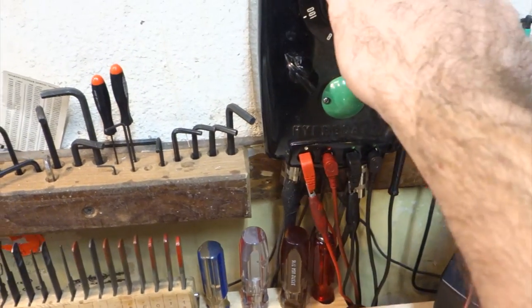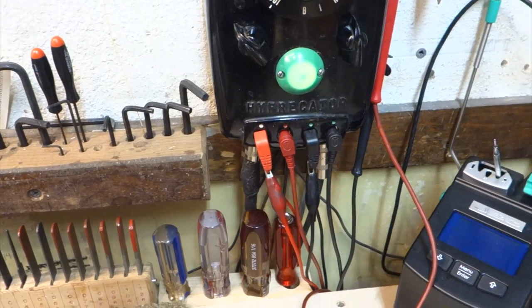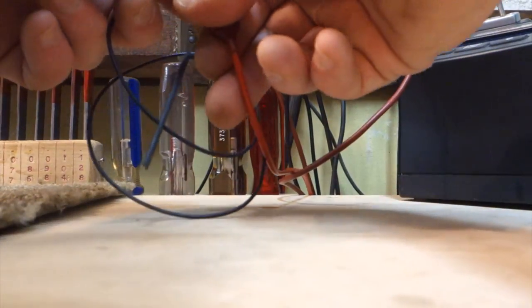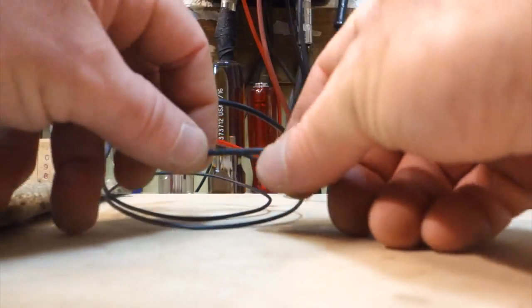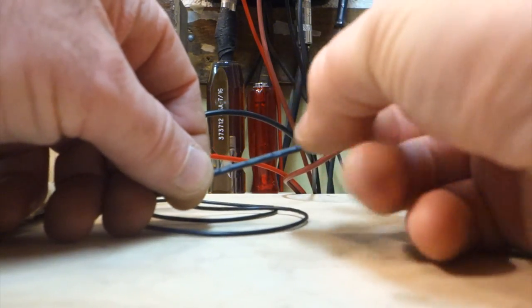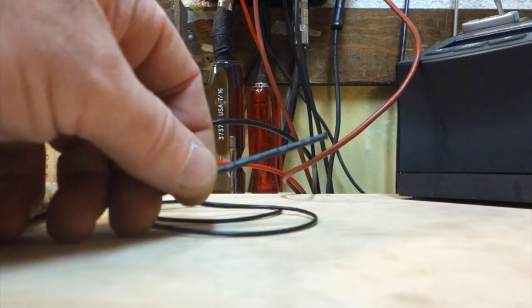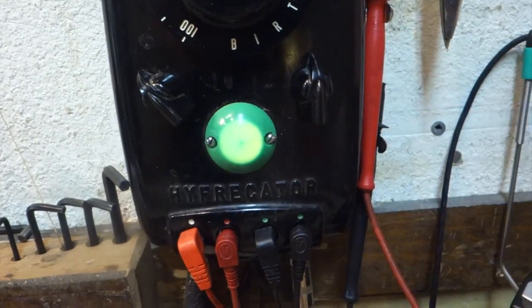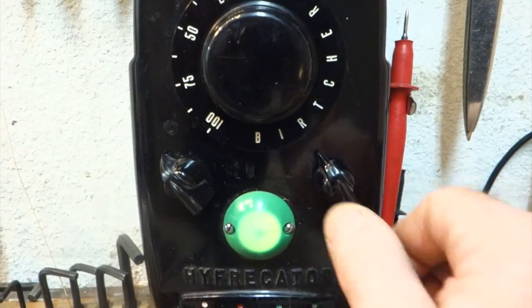We can also — although it's rarely needed — switch the clips to the amplifier. You hear a whole lot of noise there, obviously, but it can be useful when we're trying to test something which doesn't read easily on a meter, like a transducer pickup. Hook that up to the clips, and we can isolate just the clips alone. This switch allows us to isolate clips, both clips and pin probes, and then just the pin probes. I usually leave that in the center.